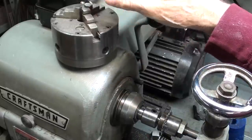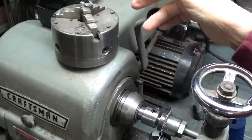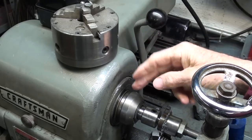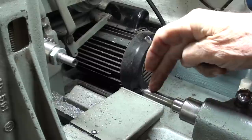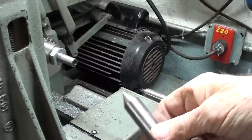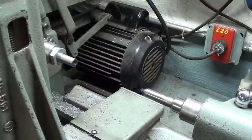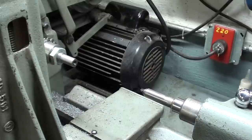I would tell you not to use a three-jaw chuck for this gear cutting operation, or any operation where you are running in reverse, because you could very well spin the chuck off. Now, this is kind of a weird tailstock center that I have here, because it's extra long. This is what a normal dead center would look like, but I wanted the extra reach because there will be interference if I use a short one or a ball-bearing live center. No one's going to have one of these, but I am using the CMD Extreme Pressure Lube because it's a dead center.